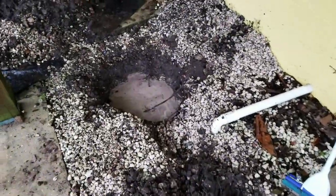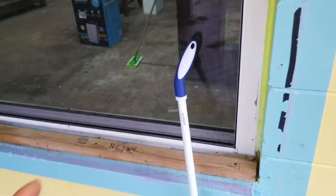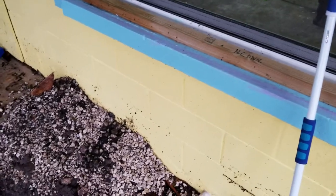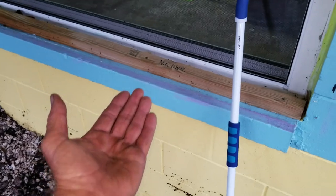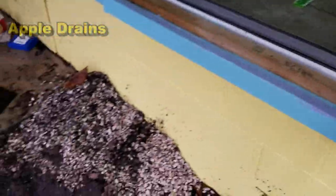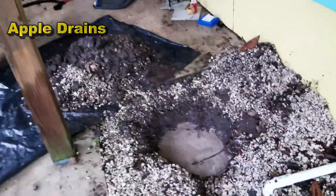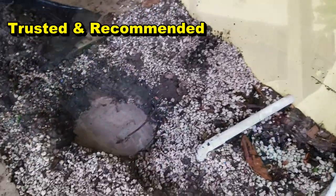The reason we're putting this sump pump and pit in here is because this basement floods. Groundwater rises up — you can see how high that water is — and it pushes through the basement floor. We could cut the floor inside, and inside would be a little bit better, but cost is always an issue. So let's go ahead and put it out here, because this entire area floods also. Why not try to get both pieces with the same amount of work?